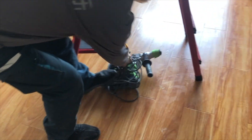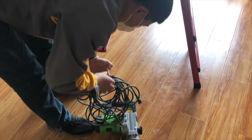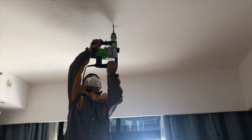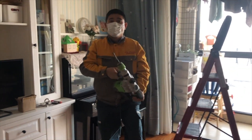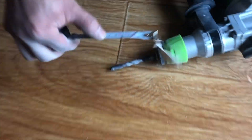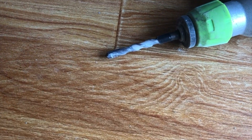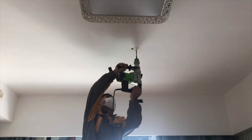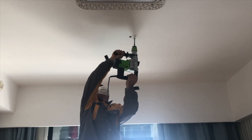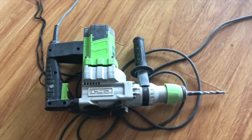He's got a huge drill that he's gonna use. My drill is teensy tiny and his drill is massive. So let's just hope that this actually works this time — it's a moment of truth. It's important to put some tape on his drill bit to measure out exactly how deep of a hole you need to drill. This is a powerful hammer drill — you can see when he drills it's pulsating, going up and down. That's what you need to drill into concrete. Here's the drill he was using before and that didn't work, and here's the drill he used that worked.